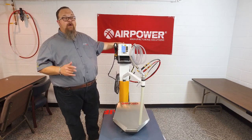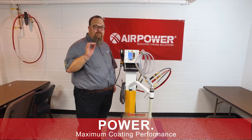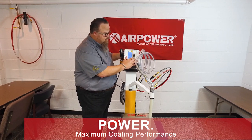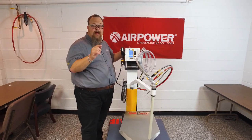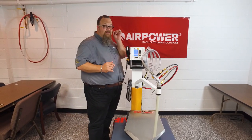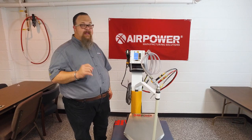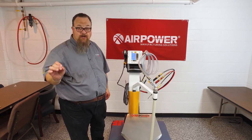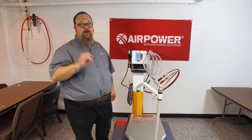Let's talk about power — specifically, Power Boost Mode. This is the first gun of its kind. I'm going to show you something right here: 110 microamp and 110 kV. I did not say 100 — I said 110 kV and 110 microamp as well. That gives us a ton of charging power. It's the highest powder charging capacity in the industry, delivering outstanding coating performance. You can coat faster and build more millage accurately with this gun. Precise charging is what we're talking about.